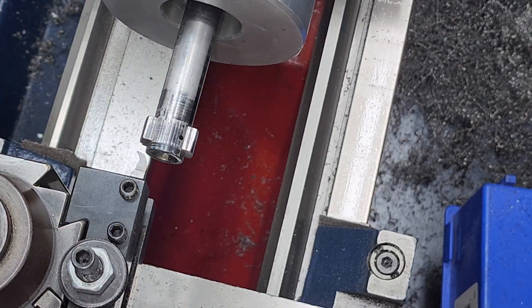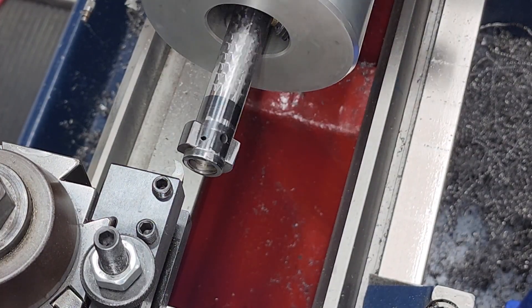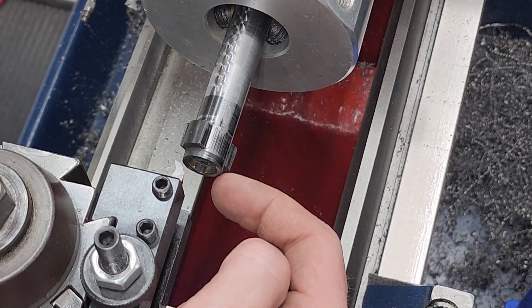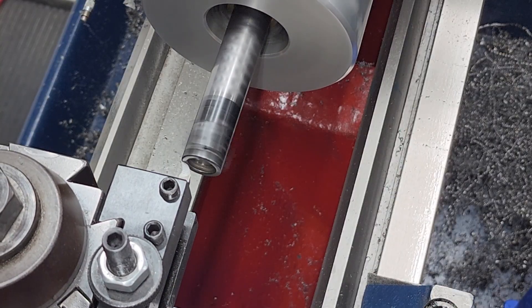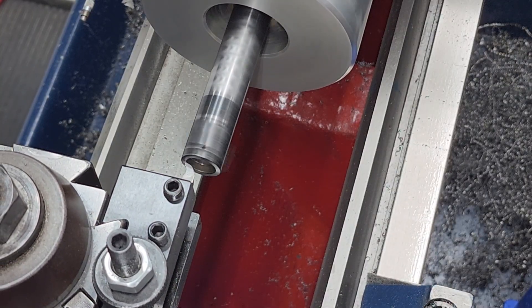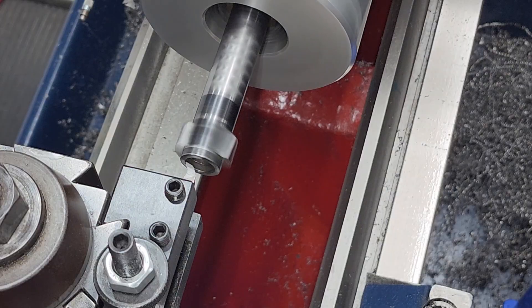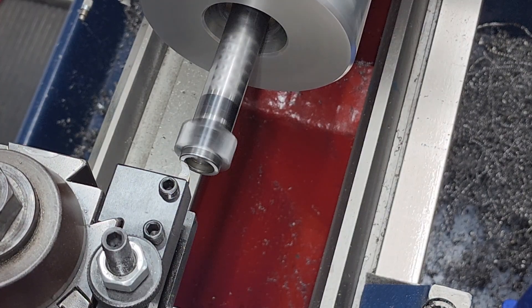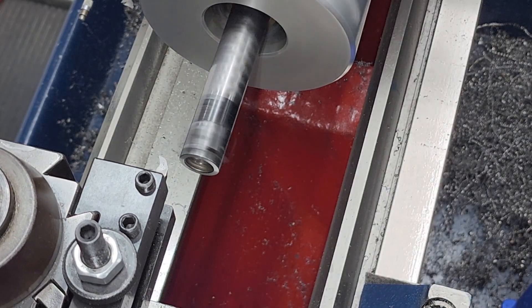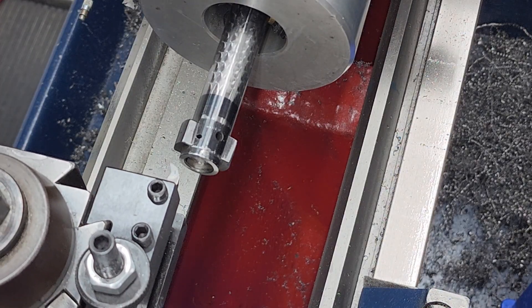Just to show you how far out they are - you can see it's just touching right on the edge there. About two thirds of it is cut. One more thousandth. That's pretty much all that's needed - good enough for what we're going to do here. Then we're going to go back on the lugs and turn this thing in reverse.